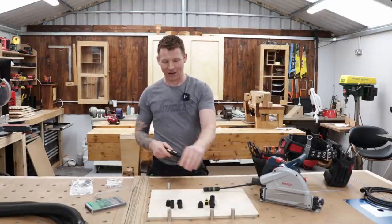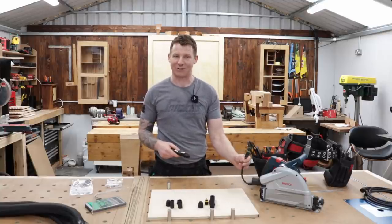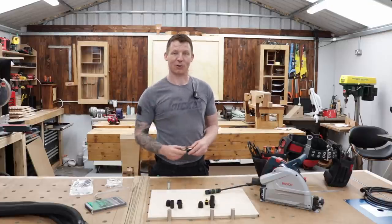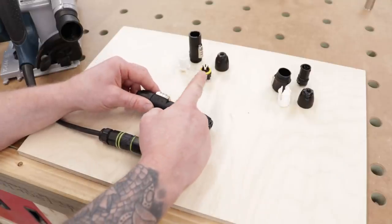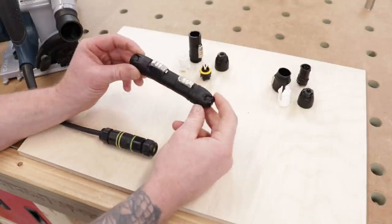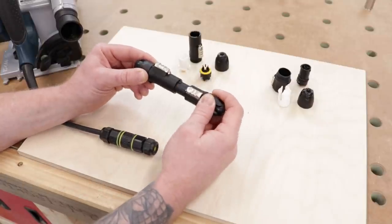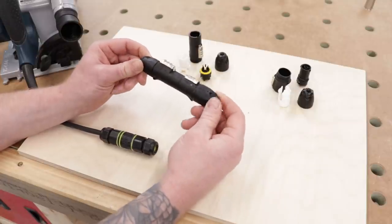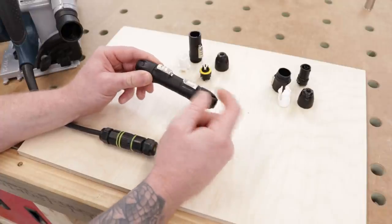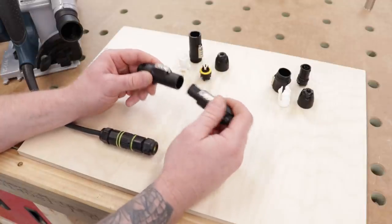I'll take a look at the plug and socket broken down to their component parts and show you how they go together, because they're a little more involved than the connectors I used previously. Here's one fully assembled so you can see the mechanism - it's really nice. It's just a case of pull back, quarter twist, and it's out, and it locks in place. These are locking connectors, which is really important - as I explained in the last video you don't want to use anything other than locking connectors for your power tools. They lock really easily and nicely.